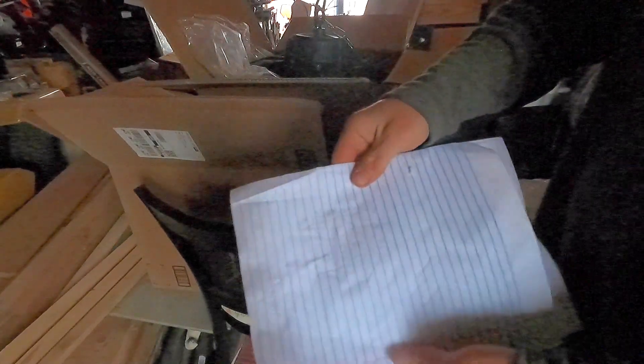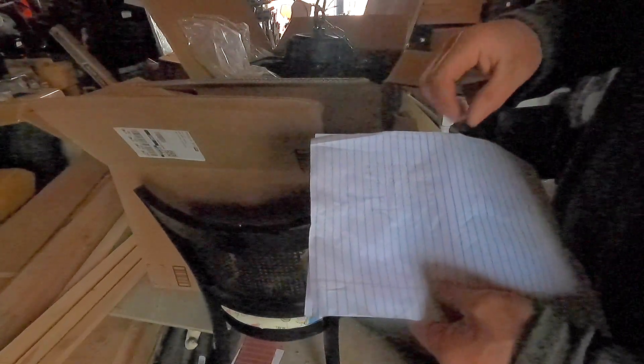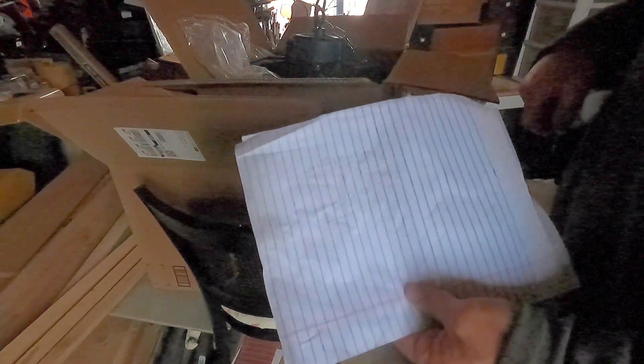The way I'm going to set these up — I just did some quick math on scratch paper — I'm going to set them 10 feet in from each wall with 20 foot spacing in between each light, which will give a 10 foot radius around every light.